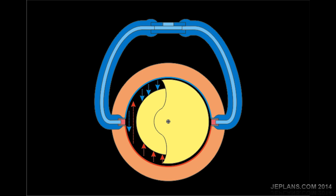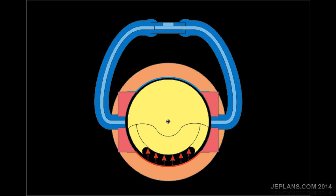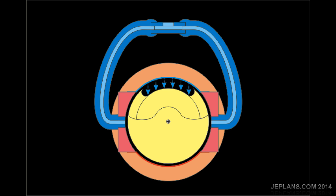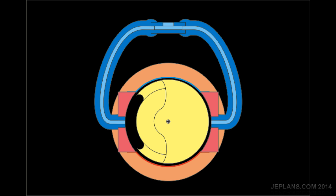Also on my plunger type displacers, I would never only have a quarter inch separation between the hot and cold layers. I would typically have a minimum of two times the distance of open space, usually quite a bit more. This would require a rebuild of the displacer cylinder, like so. After changing the displacer cylinder like that, it only makes sense to modify the displacer one more time to match it more closely. So if I adapt my design to match what I would do on my normal displacers, the first issue pretty much goes away.